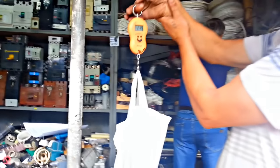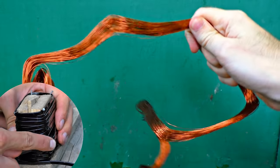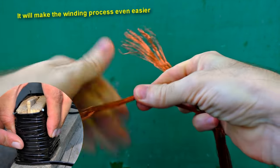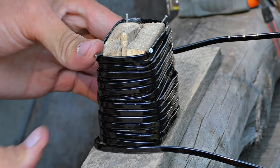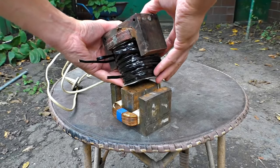I bought a thick wire for winding with 2 mm cross section, and I've made a former to make the winding easier. If you want to make it even simpler, use any thin wires made in bundles. You need to twirl these bundles and then wind them around the former. We've wound the wire 54 times, and made two tap-outs at the 4th and 47th rounds, so that we could change the current for different welding processes.